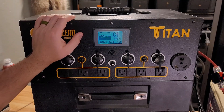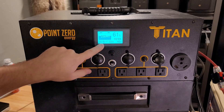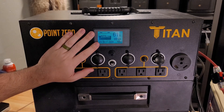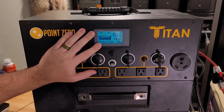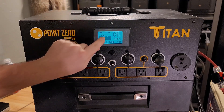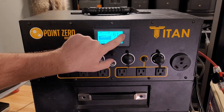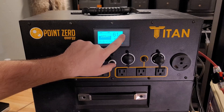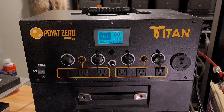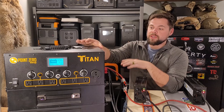It is now after eight o'clock at night and this is finally done charging. There's still a little bit of power going in — we haven't officially reached 29 volts. This will take another couple of hours to hit that 29 volt mark. Once it hits between 29 and 29.1 volts, it's supposed to reset the screen. You push this up arrow and you automatically force it to read 100%. So now I have 422 amp hours at 100%, and we're almost up to 29 volts.